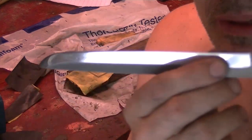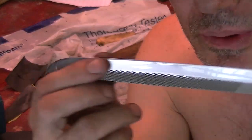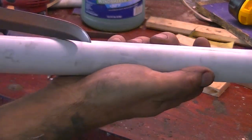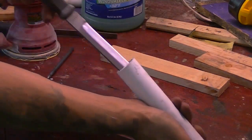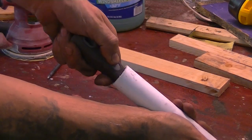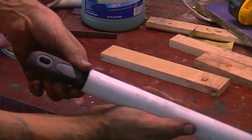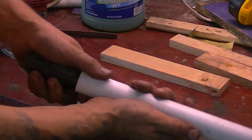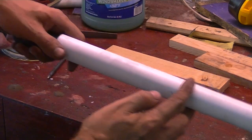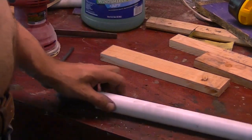I'm still removing micro scratches — up to 600 and going up to 1500. For the sheath: take your one-inch PVC and bring it down to about here. You see it snaps in, so when we put the heat to it it's going to contour the handle and make it nice and tight so the knife can't come out by itself. All we're going to do is heat this up and press down where the blade is and you'll have a really nice sheath.